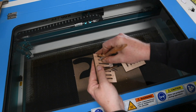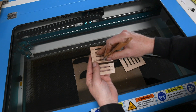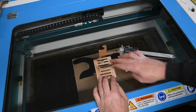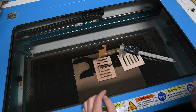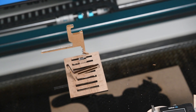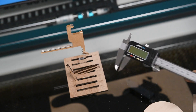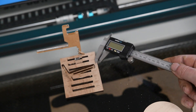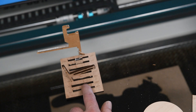That's quite a tight fit — the nice thing with these gauges is you can test fit it. That one's a bit tight and that one's a little bit loose; you could go 3.775, right in the middle. If you're using one material a lot you might be best to cut one of these gauges with three or four sizes right around that material thickness so you can double check. But calipers are the best. Hopefully this can help someone out — I do recommend getting calipers, and then you just get used to using them.